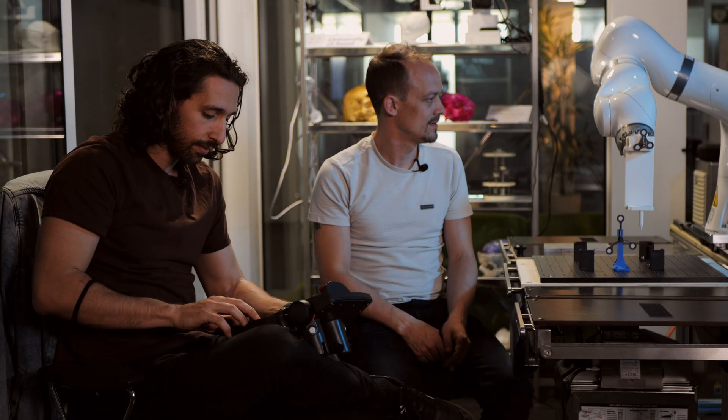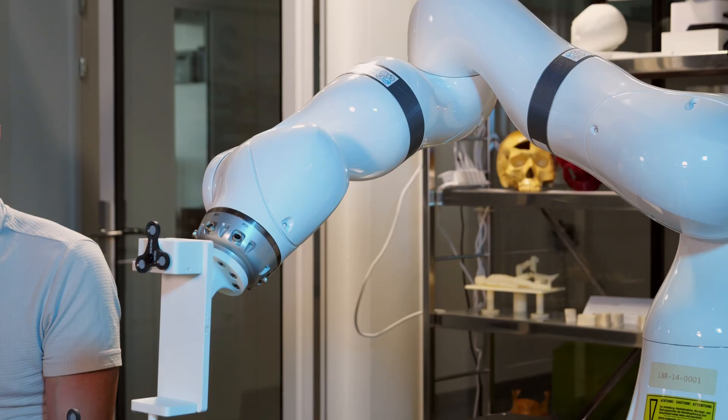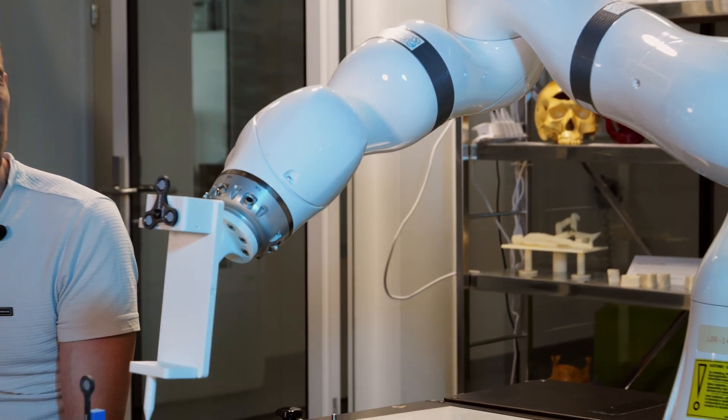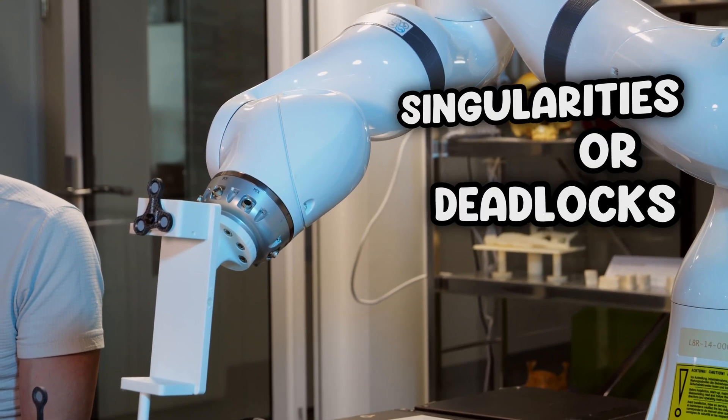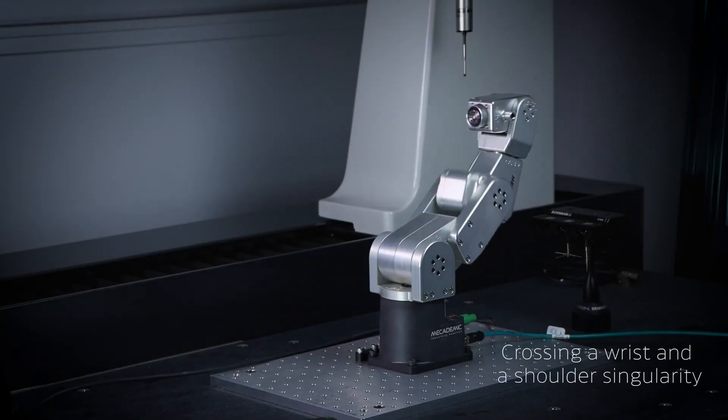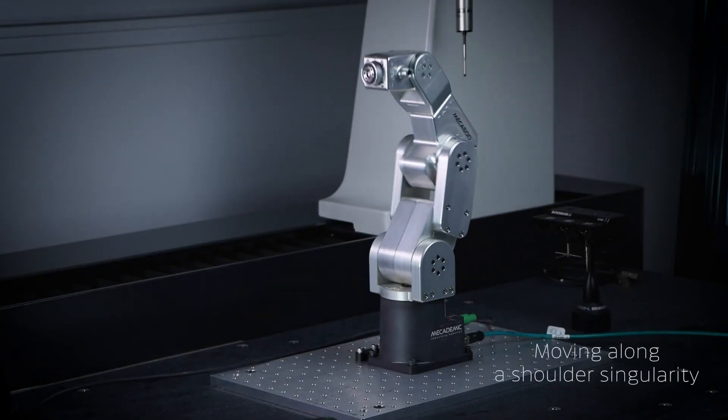The cool thing about this additional degree of freedom is that with robot arms we sometimes encounter cases where motions align with one another and cause large changes in rotation — in some cases producing singularities or deadlocks. A singularity is like an infinite number of possibilities: think of your arm completely straight, wanting to move back — you can move your elbow down, out, or to the other side. This causes problems computationally. With this robot, as we perform a motion from one place to another, we can change the elbow orientation to avoid these regions of possible trouble.